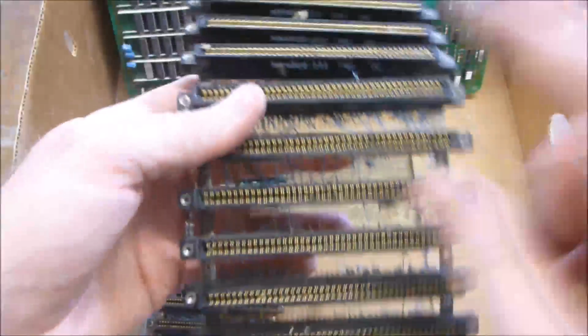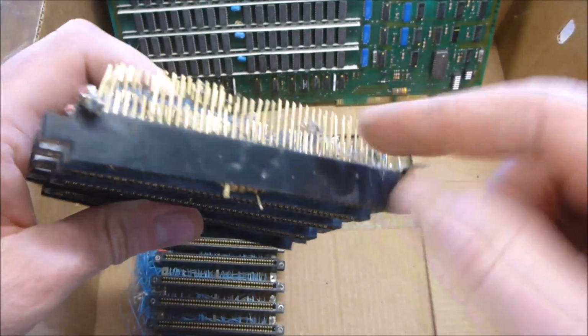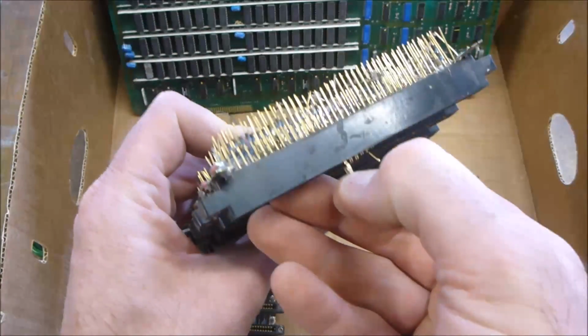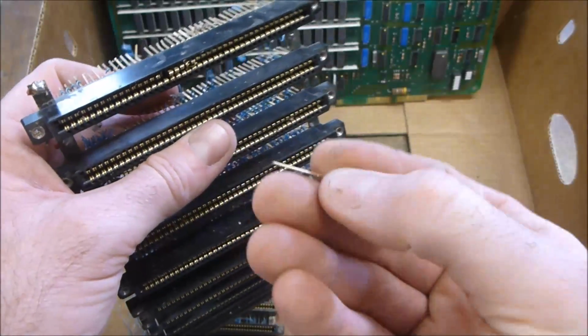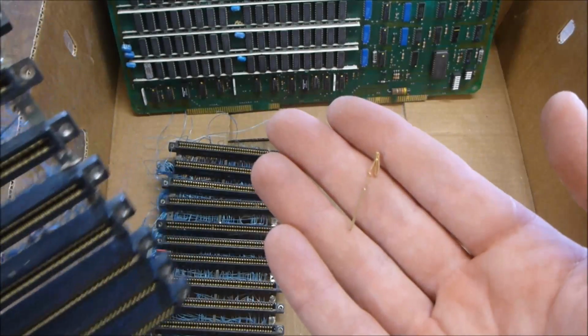And the nice thing I always love with these ones is once you pull the wire wrap off, which is not too hard, and you just put them in a vise and give them a little tap of a hammer, the pins come right out, and you end up with basically fully plated. So wire wrap, I've always had good luck as well with yields.